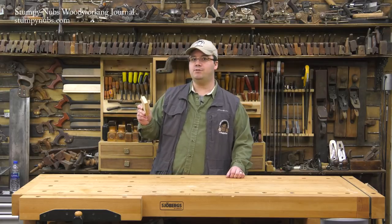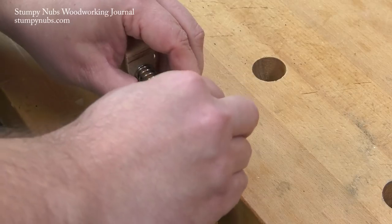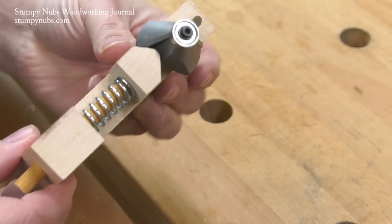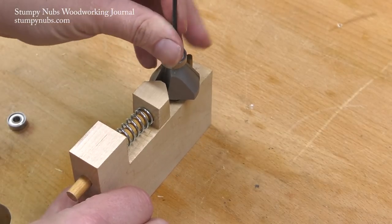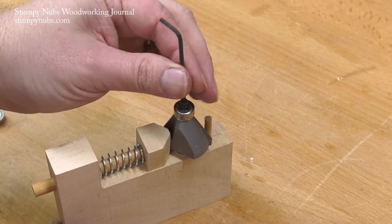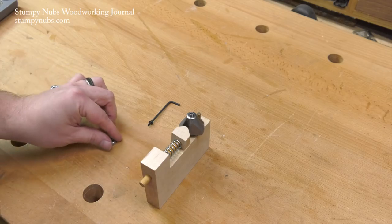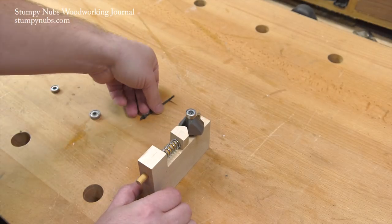That's it for this jig. To use it, you simply slide the spring-loaded mechanism back as you insert your router bit in the hole. The point on the cube fits between the cutters, holding your router bit as you loosen the set screw that holds the bearing in place. I leave my bit in the jig while I swap the bearing and tighten the new one in place. That way if I drop my parts they'll land on the workbench or on top of the router table where they're easier to retrieve.